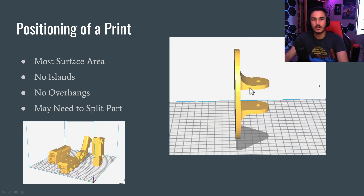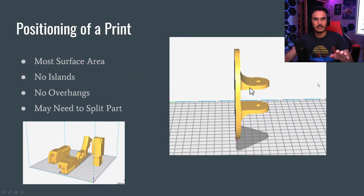You also want to make sure there are no islands. Say you're 3D printing an object shaped like this — it's stuck to the bed, prints up and up, and suddenly right at this line, something just appears out of nowhere because the printer can't go up and then back down. It has to do everything from bottom to top all at once. So that part will just be floating and fall to the ground — it'll extrude a string of spaghetti because there's nothing to support it.